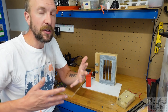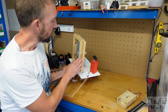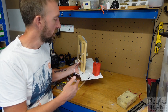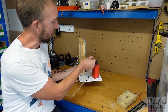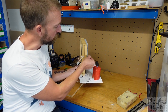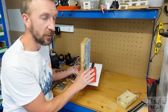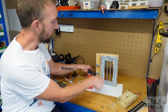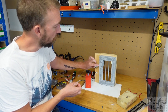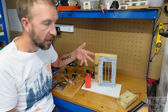The second purpose of the magnets is to activate sensors. On the reverse of the board are two reed switches wired in series. A reed switch is an electrical switch activated by a magnet — when a magnet is present, it closes the switch and allows electricity to flow. Both switches must have magnets in front of them. If no charges are placed, or only one, pressing the plunger does nothing. Only when both are in place and the plunger is pressed does the door open.